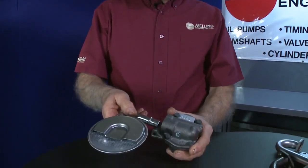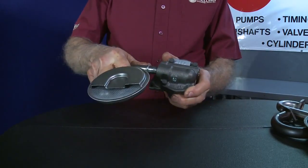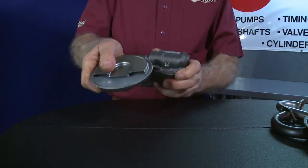The second reason to replace a screen is if you have a press-fit type screen. Once the screen has been installed in a pump, you lose the interference crush-fit that holds the screen tube in the pump.